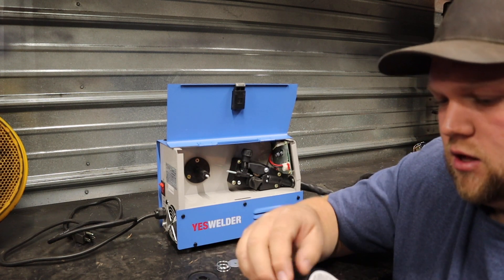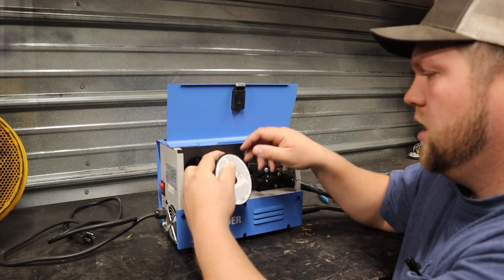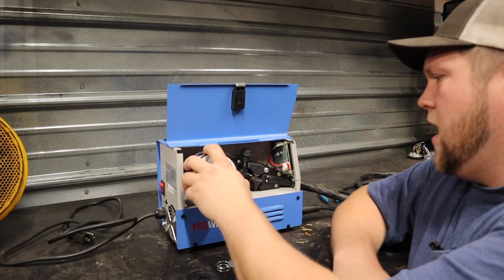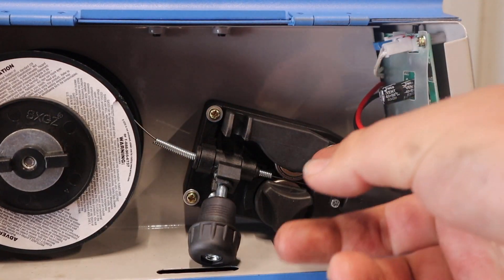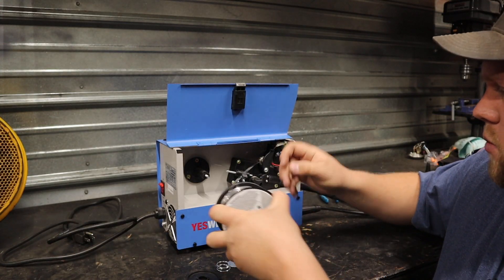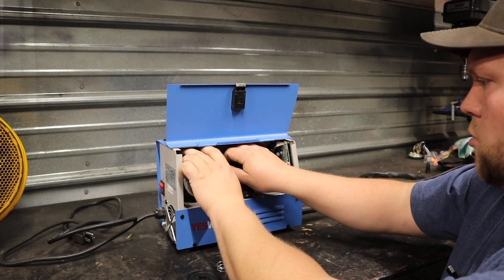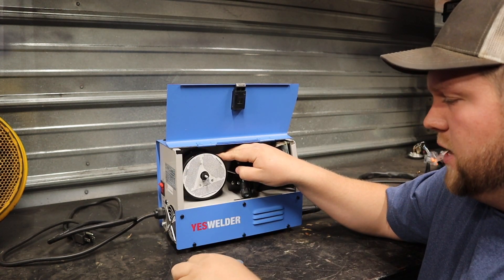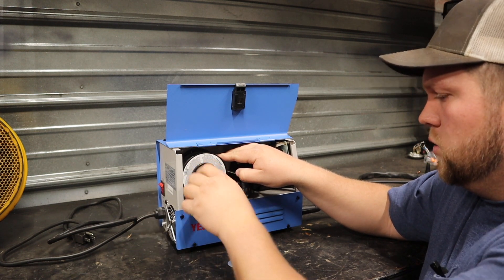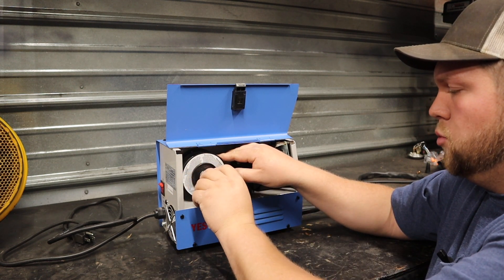On this welder in particular, the angle of my wire drive mechanism kind of sweeps down from the top. So I'm going to insert my spool where the wire comes up over the top, release that, flip up my wheel. It might even be easier to release some of the wire, stick it through this little feeder spring, then put the spool on. Once the wire is running through that spring, it might be a good time to put your cap on, which you will have to adjust a little bit later to get the right tension on the spool.